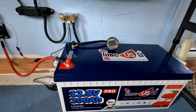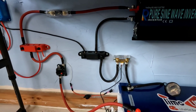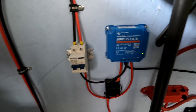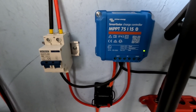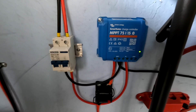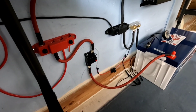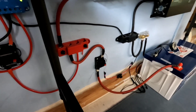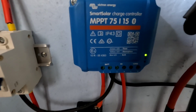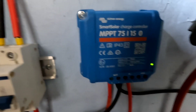This is the little power station I'm using for charging batteries. I've showed you how it was all put together and what components are used. The charge controller on this particular charging station is the Victron Energy SmartSolar charge controller, the MPPT 75/15. It only has 200 watts of solar panels hooked into it — for this charging station I don't need to charge any faster, I can be patient with these batteries. That green light on the charge controller is the float indicator, and it's been like that all day.